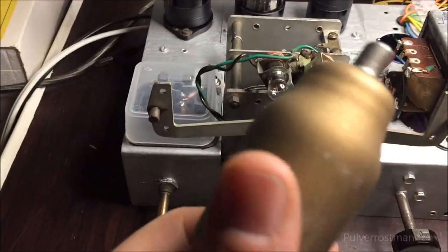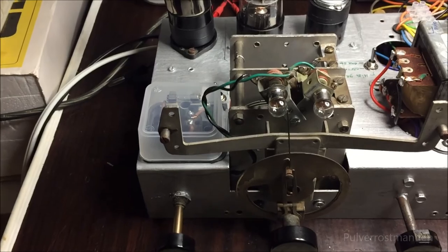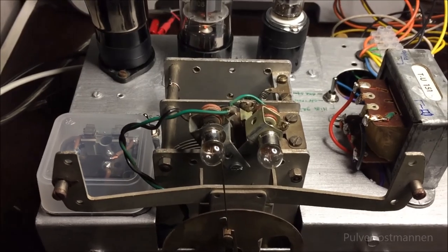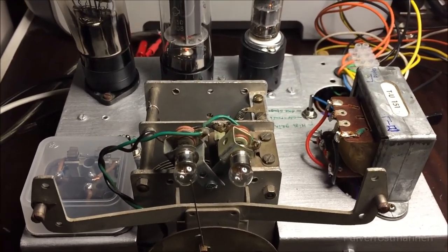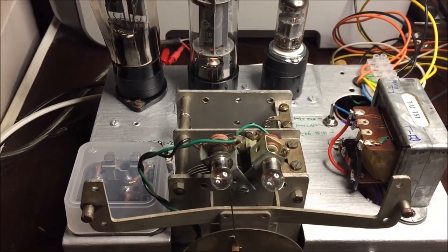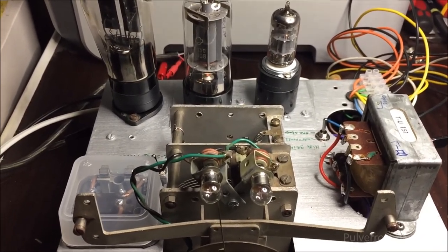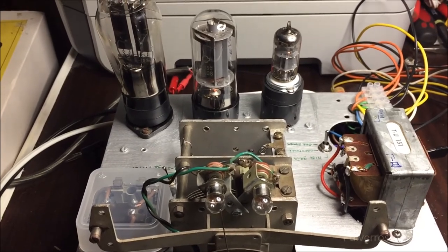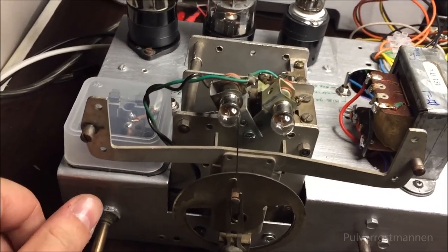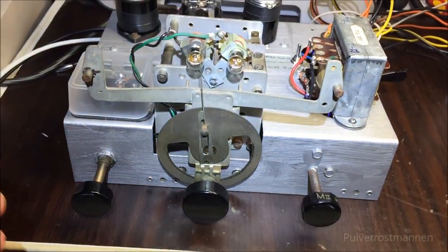It had these old tubes in here, and someone thought this machine was wall powered, but it was not. It was a battery powered one, and the cord that came out from it required 2 volts, and somebody probably put it into the wall socket with 220 instead, so pretty much everything had exploded in the bottom of this radio, and it was all rusty. It was in very bad condition, so it was quite a challenge to make this one work again.